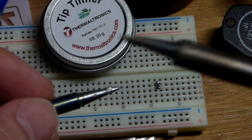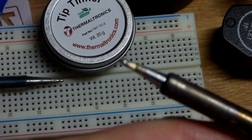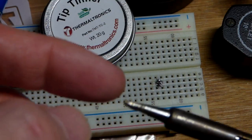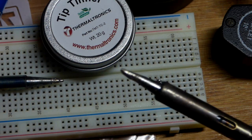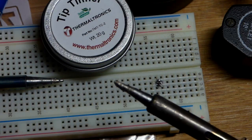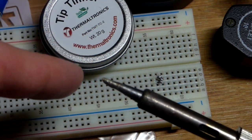With this tip you can see I got a ball right there and it didn't spread very much beyond that area. This one has a big blob on it. I'm trying to get solder on it so that none of the steel is exposed to air — get a layer of solder over it before it cools down, then clean it off and put another little layer of solder on there, which is tinning it. You can use flux and tip tinner before you put a little solder on there.